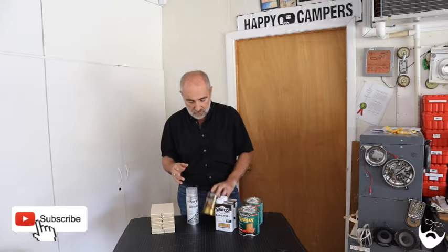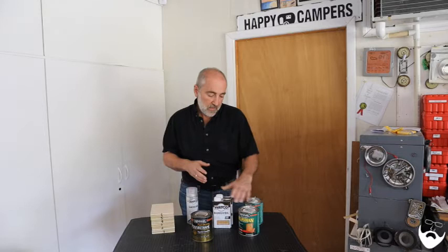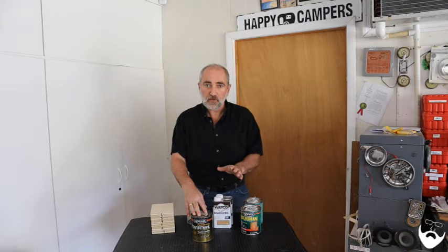There are several common wood finishes that you can use, including polyurethane, Danish oil, and a spar varnish. Polyurethane is a very hard surface. It must be sanded in between coats to give you a good finish. But remember, we're not looking for fine furniture finish here, so you might skip that part.